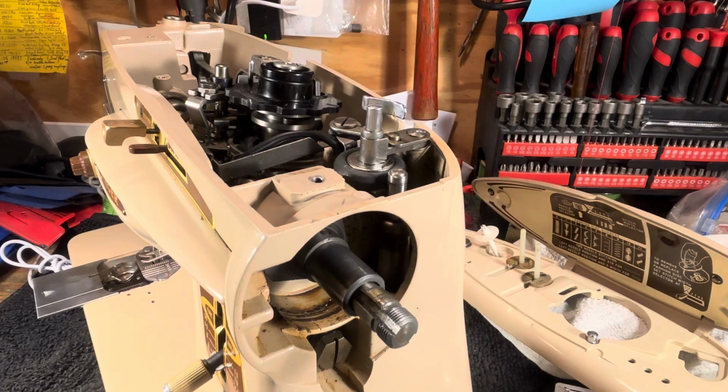You don't. I have extra motors for these machines, and I'm thinking one of these days I'm going to get an extra motor and use it. Nope. The old ones keep being reconditioned. I'll put new motor brushes in them. You know, that's usually the worst of it if they're really gone or somebody's tore them out. But sometimes you guys get adventurous and you take the motor apart. Don't ever take the motor apart.